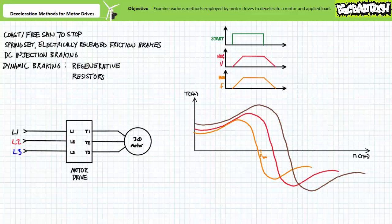If the motor and applied load happened to be rotating at rated speed prior to the start of the ramp deceleration event, the reduction in excitation frequency drops synchronous speed and places this same point on the generator side of the torque-speed curve. The counter torque of the generator action therefore opposes the rotational inertia of the spinning load and exports electrical energy. As the ramp down of excitation frequency progresses, the torque-speed curve continues to change such that it continually decelerates the applied load. The excitation frequency ramp down process isn't just some passive event, but rather an active deceleration event known as dynamic braking, which temporarily turns the motor into a generator. Regenerative dynamic braking converts the mechanical energy of braking into exportable electrical energy, which is stored in the DC link or sometimes even fed straight back to the grid, implying that the whole drive might be bi-directional in nature and have sufficient capacity to absorb, package, and dissipate the resultant electrical energy.